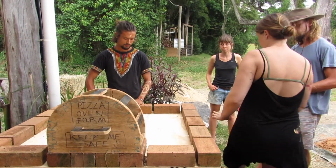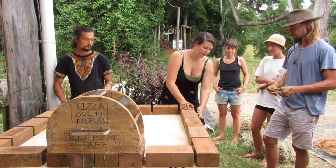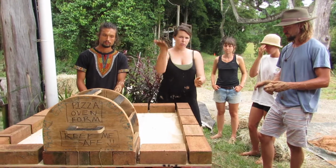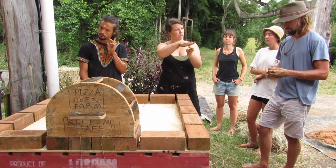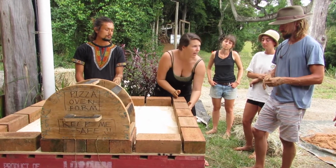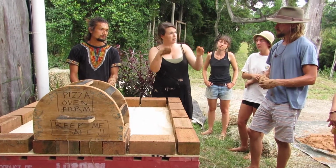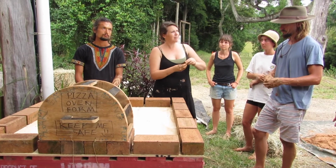Ideally, what we do when we render is that we come down. We won't worry about the pallets. We're looking at the edge of the plaster. We call it a drip edge. So you don't want the plaster to exactly meet the surface below it, because then water can go inside that material. So what you usually want is a bit of an overhang, so the render sits out. And we make a tiny little lip on it, so the water will drop off, just like the end of a gutter or something. Does that make sense? Yeah.